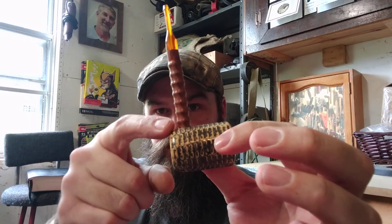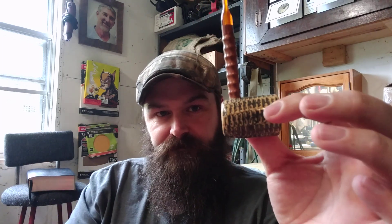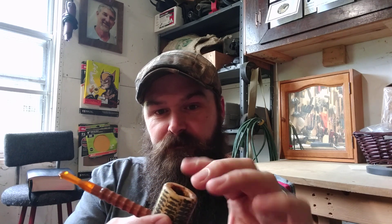Drilling the hole on a long stem like this — I'm not set up to do it on my lathe — so it's not that easy. I went through several stems over a couple of days and finally got it right. I also did a briar plug on the bottom, drilled it all the way through. Some of them come with a hardwood plug but it's super thin, so since I've got the shank up I put a thicker plug in. All briar plugs.